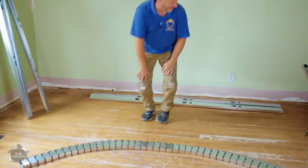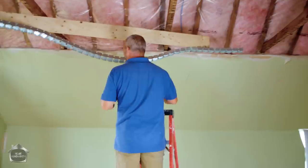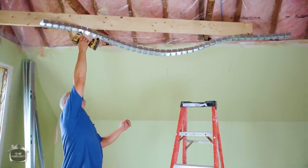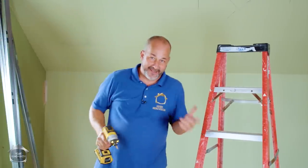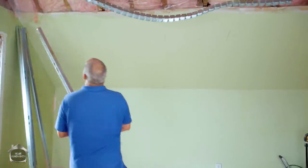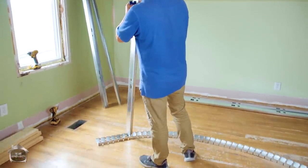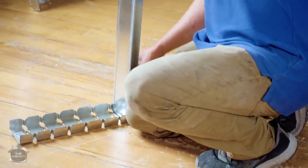The top and bottom are almost identical, and because it's steel we can put the top plate and bottom plate in independently — we don't have to attach the frame all at once. I'm going to go up to the ceiling at two locations, attach the frame there, then put the steel studs from those locations down to the bottom plate. I'll use the laser level and walk you through it. If you've never worked with this material before you could spend all day trying to figure it out — that's why I'm making this video.